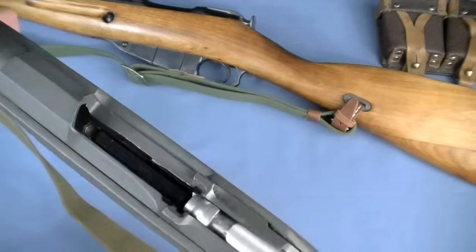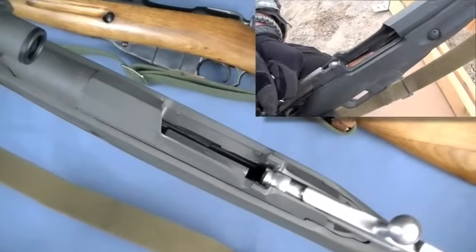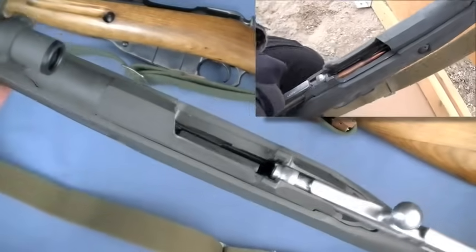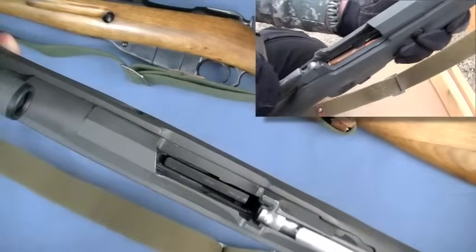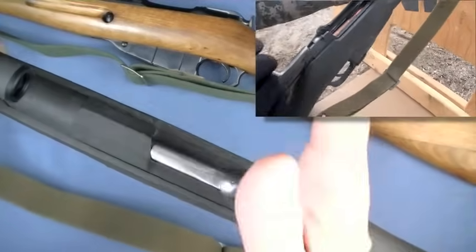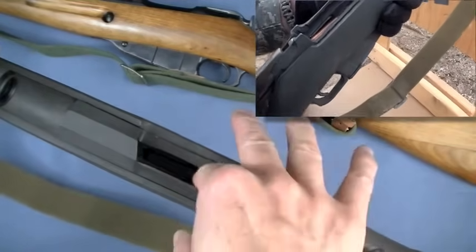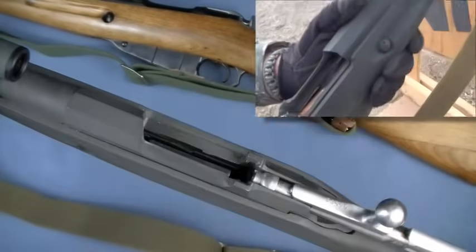The Mosin. And by the way, probably jumping ahead to reliability and durability, watch out for rim lock. But wait, the interrupter ejector is supposed to prevent that. Yeah, I know. In this particular rifle, it was really strange. We ran this hundreds and hundreds of rounds, and several times, even though we were being careful, trying to load them in proper sequence, it would jam on us. And I looked down there, and it was rim lock. And I looked down to see if the interrupter was doing its job, i.e. holding the second cartridge down so the top one can strip off without rim stacking.